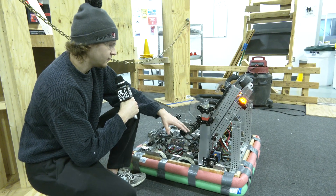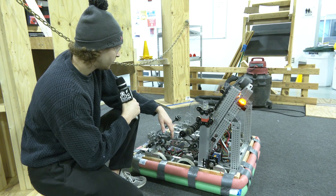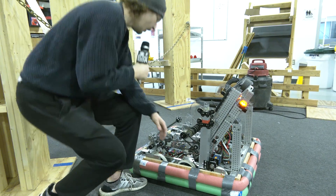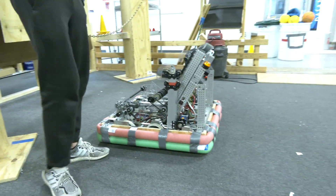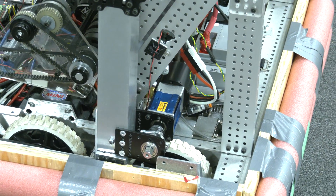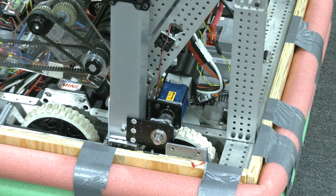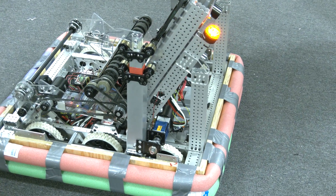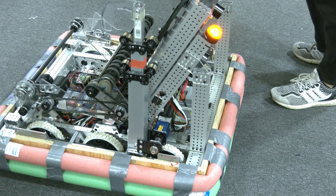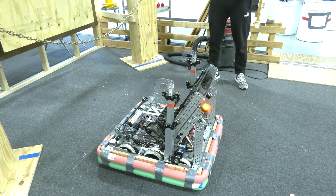The thrifty bot is really nice because it extends really high and retracts really low — assembly went really well and I could not be happier with these. Our motors are currently running on 12 to 1 gearboxes using the Sport Planetary gearboxes, though you could use a Max Planetary or a Versa Planetary — there are a lot of options for gear reduction or you could build your own. We like having them decoupled because that gives you the option to raise one side, lower one side, which is important for stabilizing the robot as you go up.